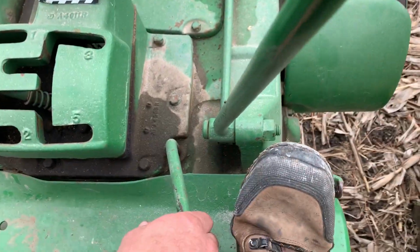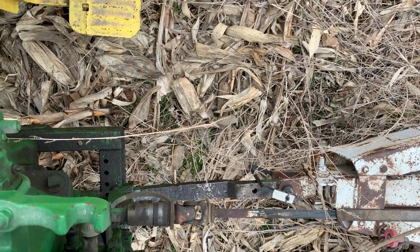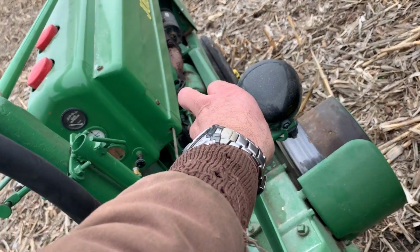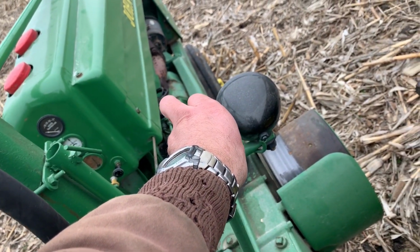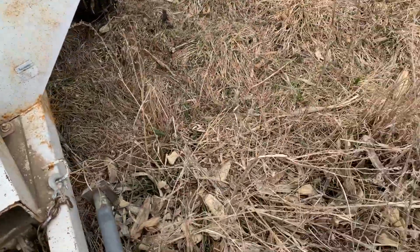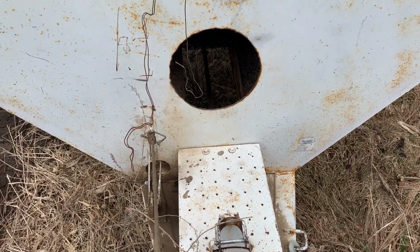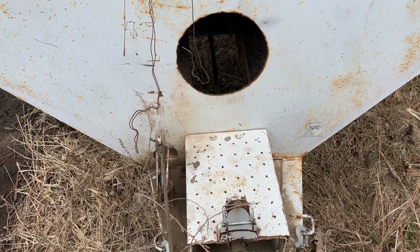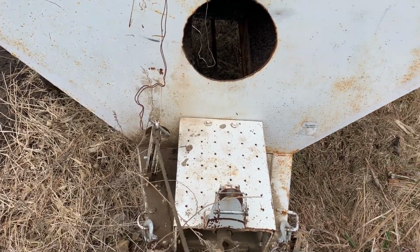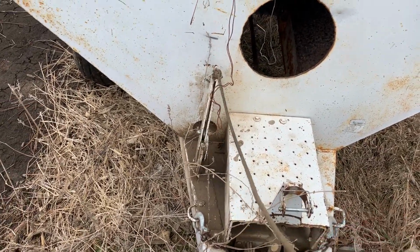Alright, so I've got to throw this lever to turn on the PTO, and that only turns on when the clutch is engaged, it's not live power. Now, we changed the rope. I'm gonna move it over here so I can leave it. I've got this rope trip, and you pull it back so far there, and then it latches, if you can see that. To unlatch it, you just give it a good yank.